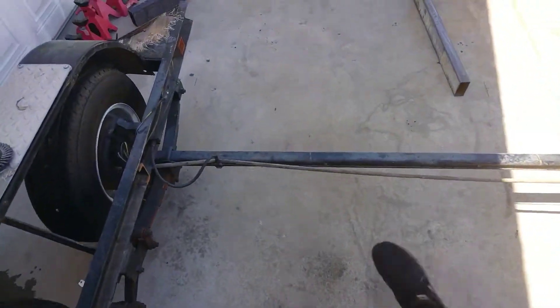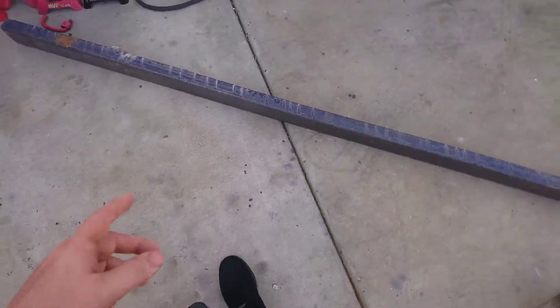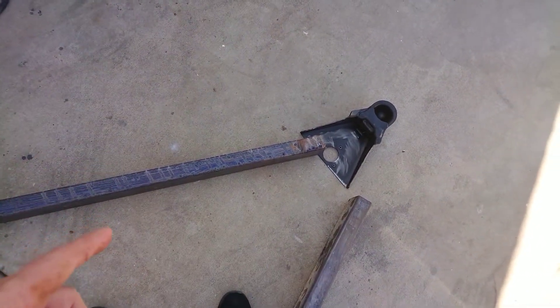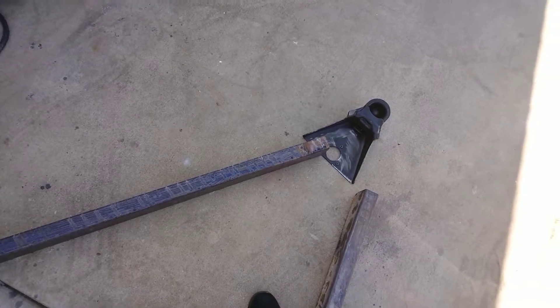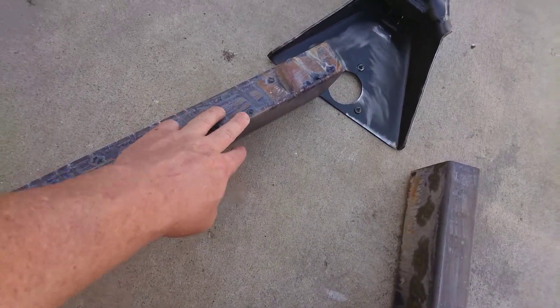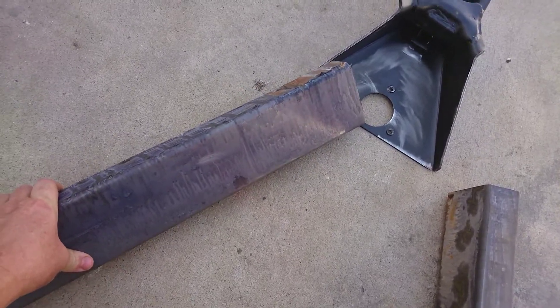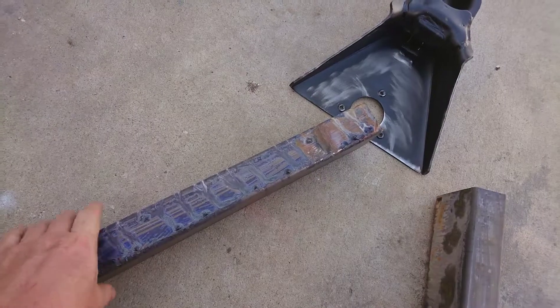You can also add a protecting jelly — you can basically paint this stuff on and it neutralizes the metal. I realized that two pieces I did didn't get neutralized on the inside, so that's why I wanted to soak the other pieces in muriatic acid to also clean the inside of the steel, and then I'll weld it. There's a protective coating on this right now — I forget the name of it, but it's basically a coating product that reduces or neutralizes any rust. The problem with that is if you go to weld you've got to clean it off, so I'll weld first and then put the product on.